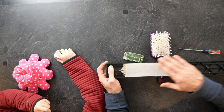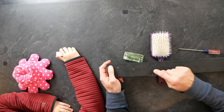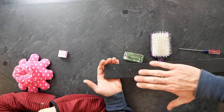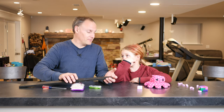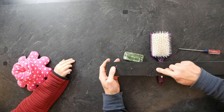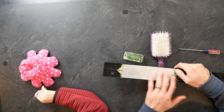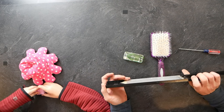But even though you have this all glued up and you have your metal in place, one thing to consider is which side to put your metal on. You always want to put the metal on the side that's going to put your crack into compression and not tension. So since we have the metal on the back side here, when I press down on this, or when a child who's jumping across the couches jumps across this, it'll bend this way and the crack on the top will be crushed together. If we put the metal on the top and we press down on it, the crack on the bottom will open up. So try to pick the side to support your metal that will put the crack in compression. And I think that's pretty much all I learned about this piece.